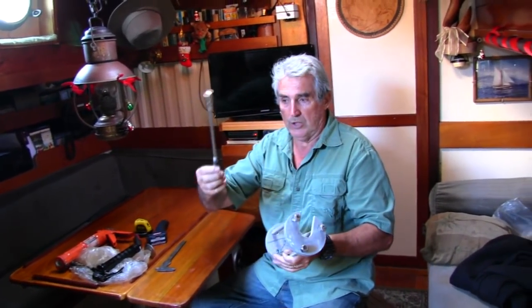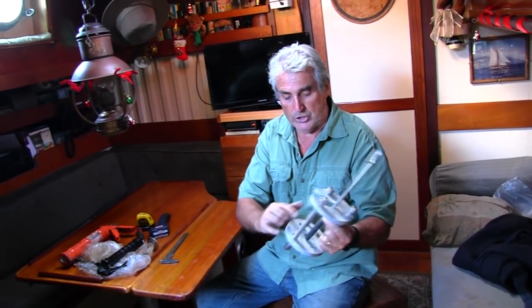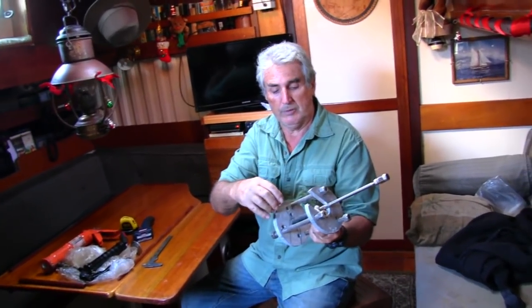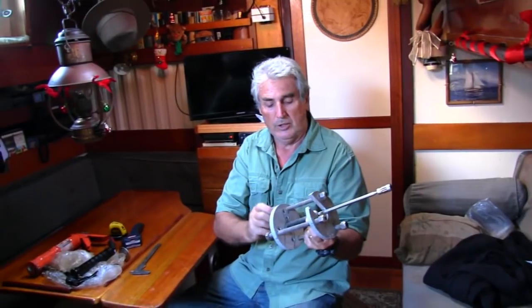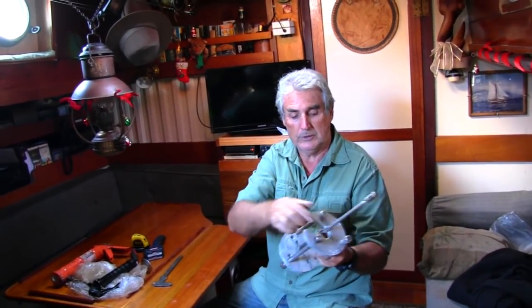And the way it works is, think of it, if that's the shaft, the end of the shaft comes inside this little hole like that, and the propeller is right between it. So as you're tightening the nuts, this part here pushes on the propeller and brings it out. So anyway, by removing the propeller, I was able to pull the shaft inward and then go outside and start